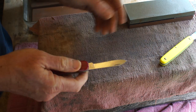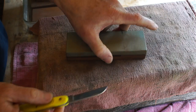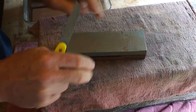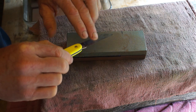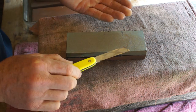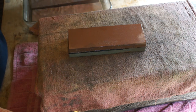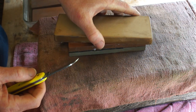And finally, how fine is the edge ground and polished? If I'm sharpening on 250 grit, which is really coarse and great for grinding, and I finish my sharpening there and go to use the knife, it's not going to be very sharp — it's going to have big coarse scratches all the way to the edge. If we flip to the 1000 side and then the 4000 side, we end up with a polished surface that's much sharper.